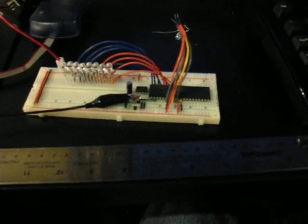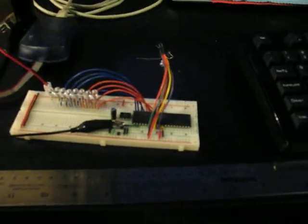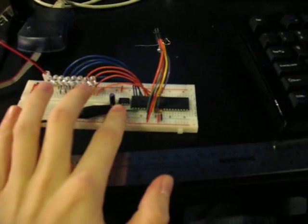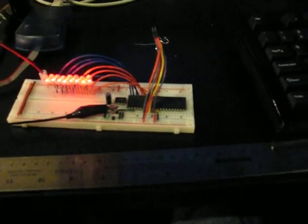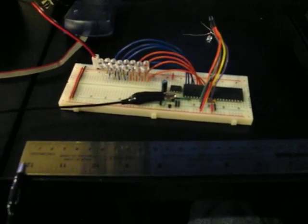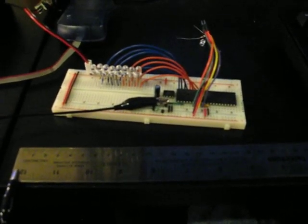In this case, I guess I'm not charged because it seems to be working, but if I rub my feet on the floor, it won't register my touches. If I ground myself, it works. So the contact for this would simply be a circle that's cut in half — one side would be grounded, the other side would be the input terminal to the op-amp.